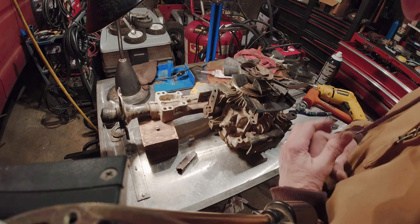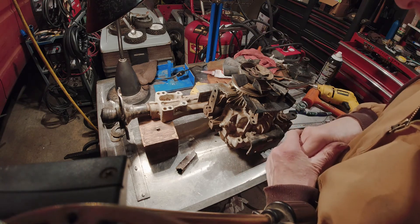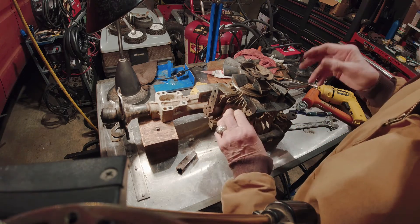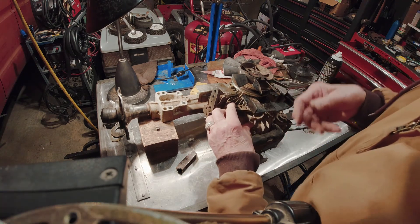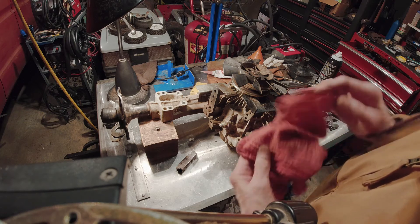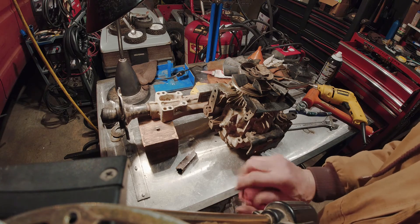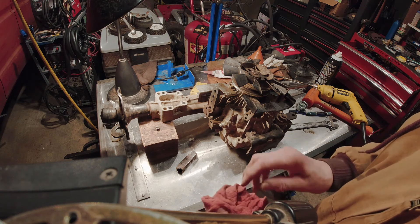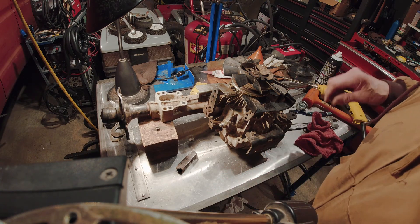That's it. I hope you've seen that it's not a difficult process, easy to do, but using the drill for bleeding the air is to me far easier than putting it on the tractor and manipulating this. You really need two guys — you need somebody in the back to manipulate this valve as you're manipulating the throttle. So this works really well. Like I was saying, it's a simple procedure, easier to do, and there's other videos showing how to disassemble the entire inside — the valves, the motor, total rebuild. That wasn't the purpose here. The purpose was to replace the bent axle. Okay, that's it. Good luck.